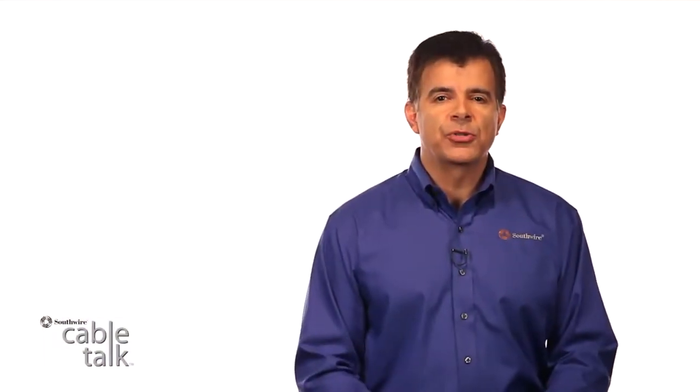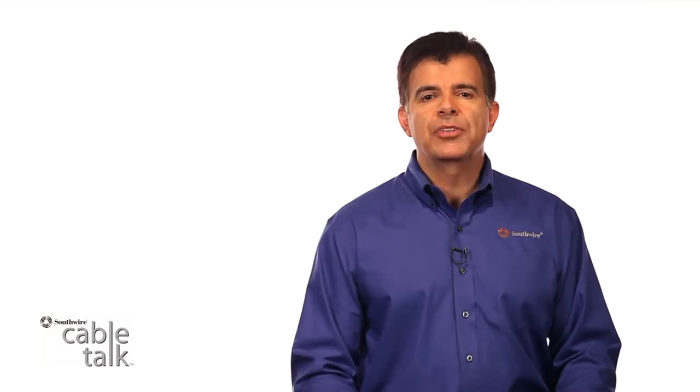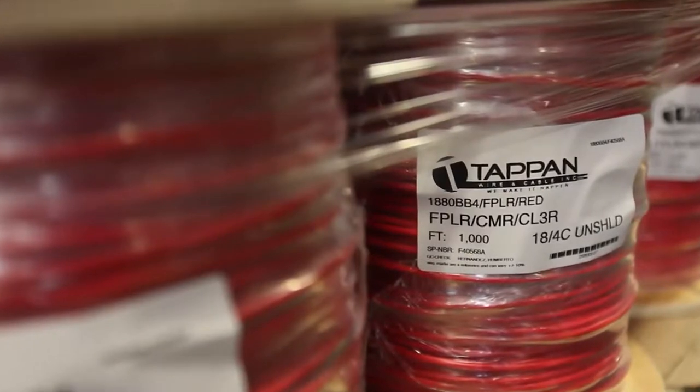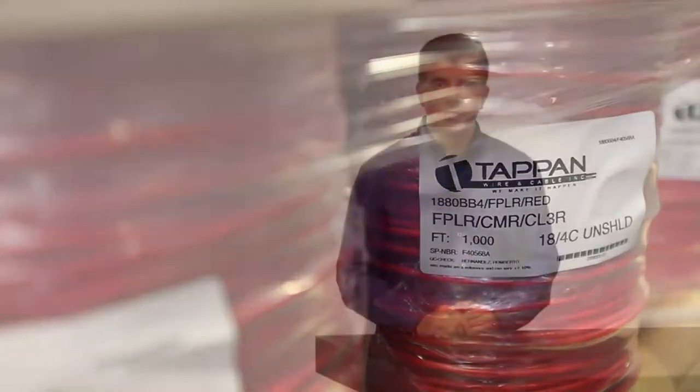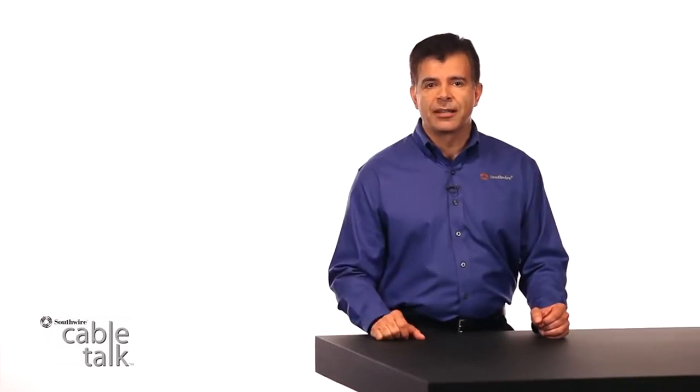Plenum is a commonly used term today in the construction and system installation industries because in most cases, plenum-rated cables may be installed in air handling systems, air plenums, without expensive metallic conduit. Plenum cable can cut installation costs dramatically. Riser describes cables having a lesser degree of flame retardancy than plenum, but may be used to convey signals vertically in shafts without requirement for metallic conduit.